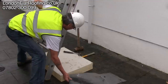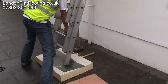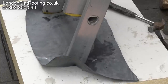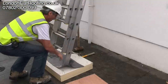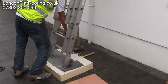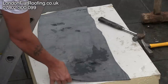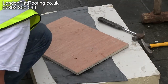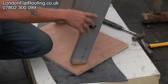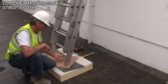If I remove the ply, now, this will work. As you will see, I can actually get on that and it works. I am going to apply some bouncing on it. Now, I am sure if the EPDM had been glued down, that would not have been so drastic. But what will happen is that will pop back, and I would not expect anybody to do that. We can see no damage to the EPDM, damage to the insulation. If everybody was careful when they were doing maintenance on the roof and they put a board down first, you would not have to board the whole roof. But that shows you both ways and shows you how good that EPDM is.